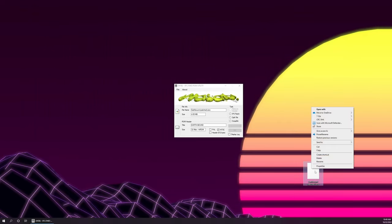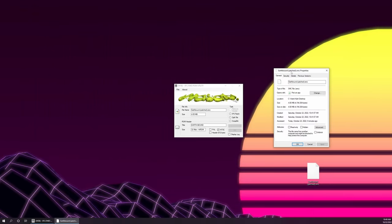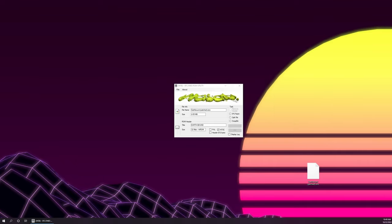You may notice that our patched ROM is 4 megabytes, which is 32 megabits. So that's not going to fit on these flash memory modules. So what we need to do is use SNES ROM Utility, load in that patched ROM, choose split file, and choose 2 megabytes, which is of course 16 megabits, and hit OK. It's going to generate two files for us, patched 1 and 2. So if we check those, see, we have 2 megabytes and 2 megabytes.